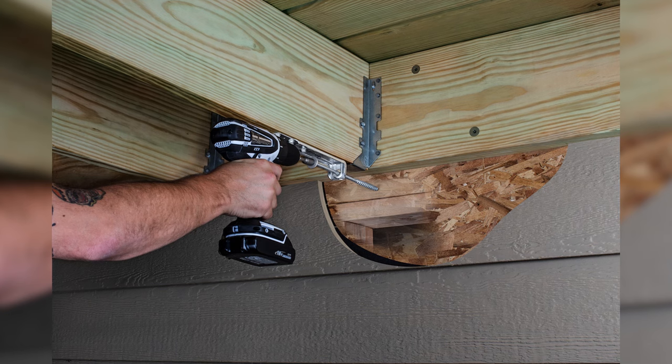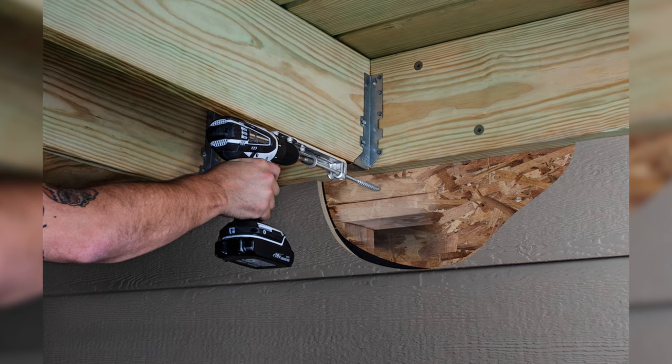The other thing we do now is you have to have some kind of a positive fastener that goes from your framework to the plate of the house. The house joists are sitting on the wall plate. Rather than just depending on that rim that's been maybe just nailed, they're now also hooking a fastener periodically on the bottom of the deck that hooks to your framework and goes into the plate. The plate is not going to pull off easily — you'd really have to rip the wall off the house. That's where tension ties come into play — the DTTs and ETs — they attach into a deck joist and then fasten into the plate. Code calls for like four minimum, but our engineer puts them every four or five feet. They don't cost a lot, and it's all about preventing pull-away.